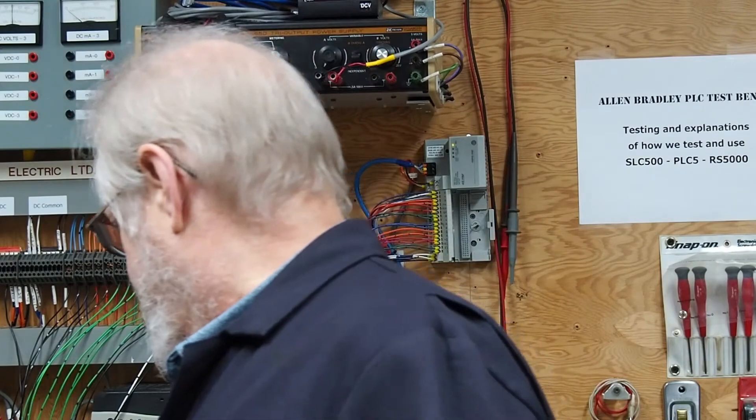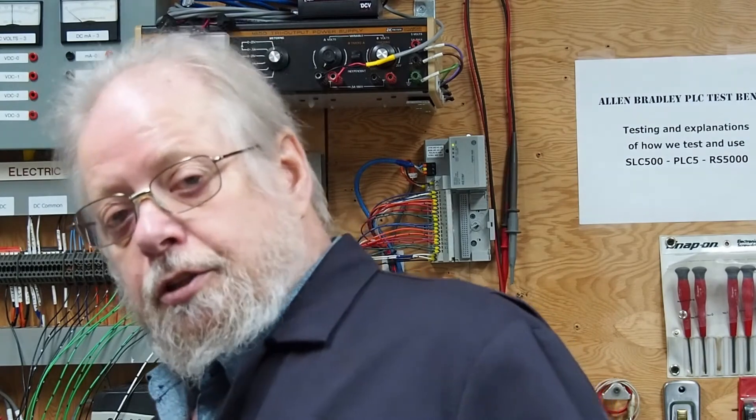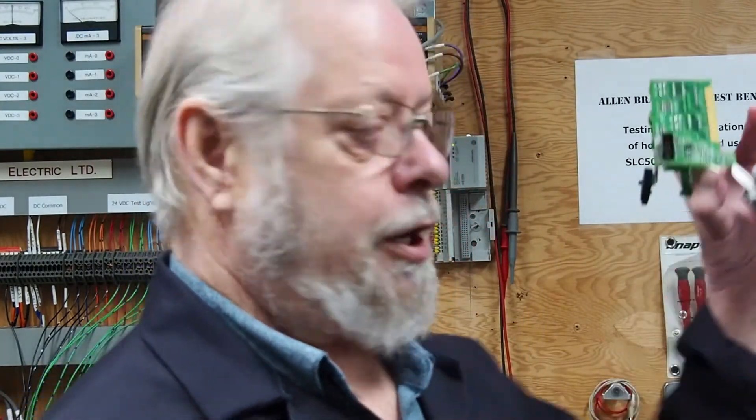This one is one I got from my supply, and relay number four is dead on it. On the other two, I have relay four and five dead, and relay three, four, and five dead. And the one my customer sent me — which is the one I've pulled apart here — as you can see, has tiny little relays in it, and relay number four is dead. So it kind of makes you wonder, is there a problem with how these are put together, particularly relay number four, because it's the same one from two different locations on the planet. Things are a little weird and it's going to take more research.